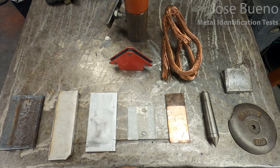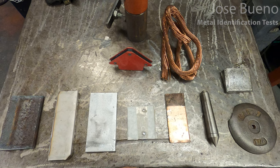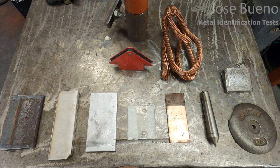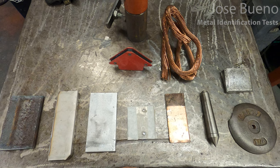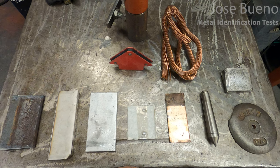Well there are a couple things that you can do. One of them is the magnetic test, where you basically just use a common magnet to see if the metal is magnetic or not — see if the magnet sticks. And then if you're still not sure, there's always the grind test, commonly known as the spark test, where you stick the piece of metal into a grinder, view the sparks coming off of it, and take note of the color and stream. That's going to help you narrow down exactly what kind of metal you have. Because most of the work we're doing is with shielded metal arc welding and low carbon steel, we need to figure out which sample is carbon steel, and narrow down whether it's low carbon, medium carbon, high carbon, or cast iron. So the first test we're going to conduct is the magnetic test.